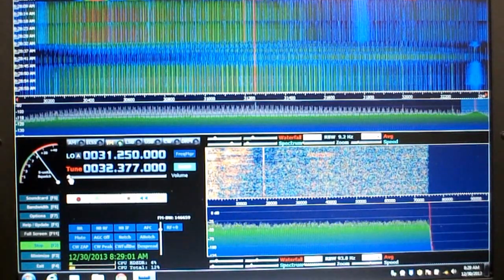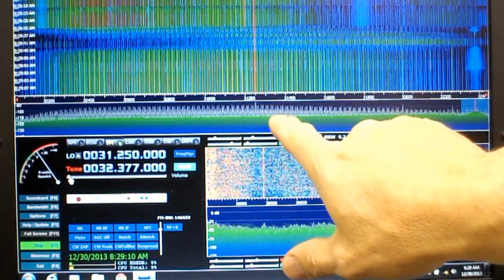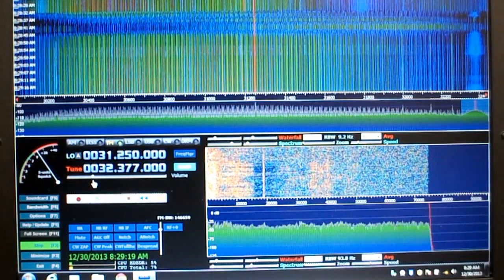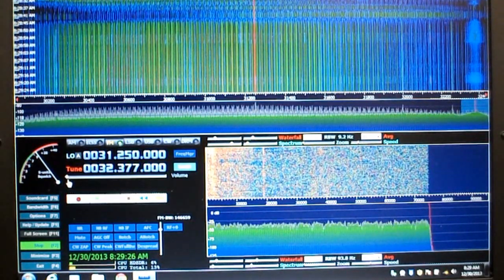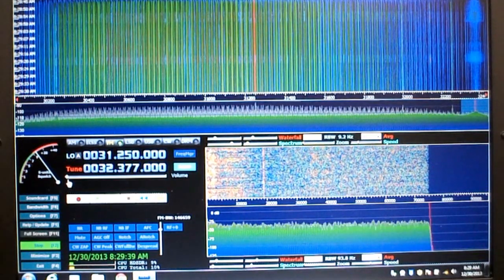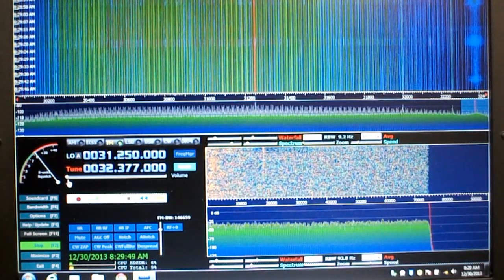I've only run into a couple of issues that aren't really that serious when you consider the cost of the device. One of them is image rejection. Right now I'm at the 31 megahertz band and there shouldn't be any FM stations, but yet here's an FM station — and that's actually one of the local FM stations. I think it's confusing the frequencies and tuning in ones that it shouldn't at this low end. There's only a problem at the low end, and once you get above 40 megahertz there's no longer an issue. Another problem is the bandwidth: the specs say it's supposed to have a 3.2 megahertz width, but I found that really it's only 1.8 megahertz.